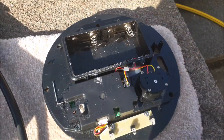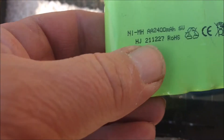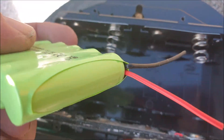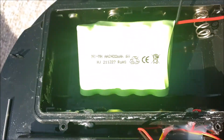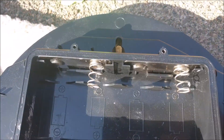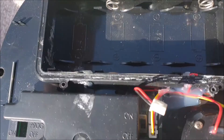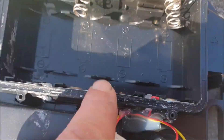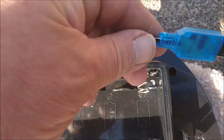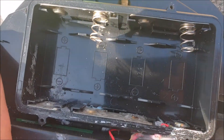I can't be having to get ladders and change the battery every six months — that's ridiculous. So today the task is to fit a rechargeable battery pack and run a piece of wire so I can power and charge the battery pack permanently from a mains supply. The charger that comes with it is a little USB thing, so I'm going to run a couple of wires — solder the positive onto the positive terminal, negative onto the negative terminal — and then another couple of wires will run out and connect to the charger via the loft.